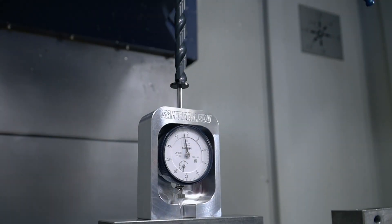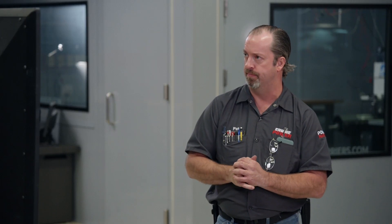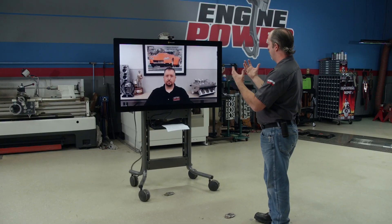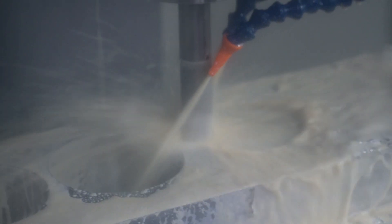You qualify your tools first — that's a pretty unique deal. You guys make your own tool qualifying fixture? That is actually a brand new project we just added to the curriculum. It's called the tool pre-setter, so students can go in and actually measure the length of their tools as they set them up, which helps produce a better and more accurate product. You use some specialized stuff right down to engraving your logo and our logo on the plate. Who determines what tooling to use for what application? That's a pretty involved question because it really depends on what we're making. If we're making a torque plate that's two inches thick, obviously I'm going to have tooling that's able to reach down through that overall two-inch thickness.